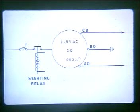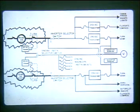The A phase of both inverters is a regulated phase and is the voltage read in the cockpit on the AC voltmeter when inverter voltage is selected. To simplify the inverter output distribution, we will use a block flow diagram using a single line to represent all phases. 115 volt AC three-phase power from each inverter is fed to circuit breakers located on the throttle lock relay box.